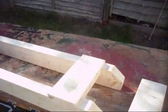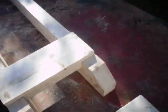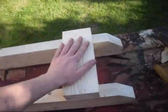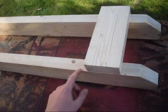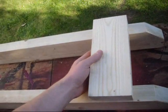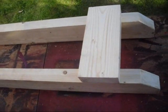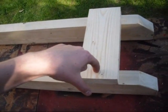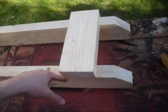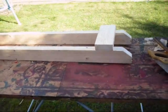So I'll just cut that one out and see how it goes. The front cross piece is sunk in, obviously not being bolted down so it'll pull up tight. Next we've got to move on to the back cross piece, which is just a simple butt joint onto the top there. We've marked it 2 inches from there. That way it doesn't look like the wheels are right on the end and it'll be screwed and glued. It'll have probably just one coach bolt through the middle and then the axle blocks will go on top and the coach screws will go all the way through as well, so it should be quite strong.